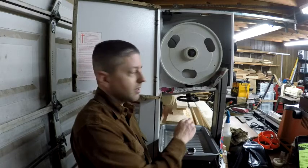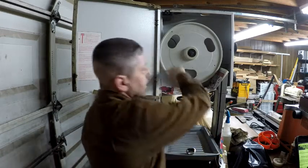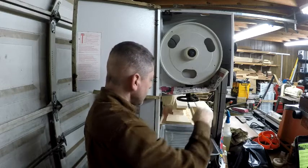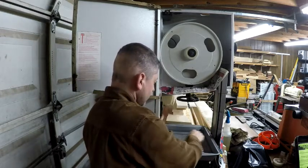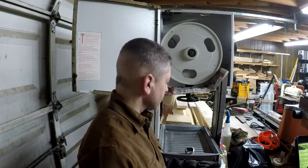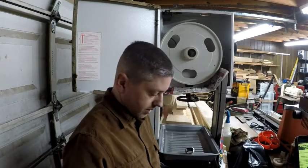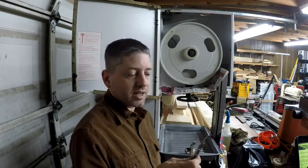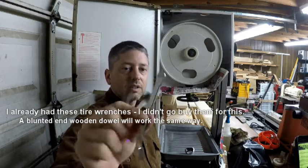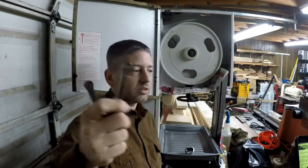Okay, as the water's coming up to temperature, I was going to take you through a couple other things. I lined this with newspaper just to catch any water that might be dripping down. I'm going to spray the inside with some WD-40. The pan is heating up. I'm up to about 130 degrees right now. 131, and I'm wearing some rubber gloves because it's going to be hot pulling it out. And I've also got this set of, basically these are for changing bike tires. They're just wrenches that are kind of spooned on the end and are going to help me pry the tire over the rim. Basically what I'm hoping, and then run it around and hopefully smooth it out that way.